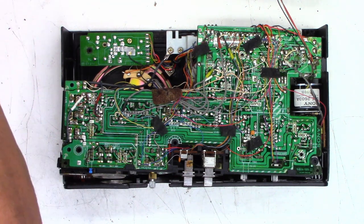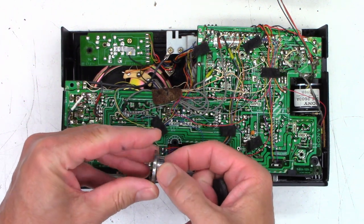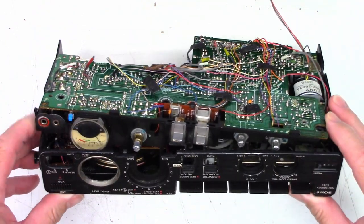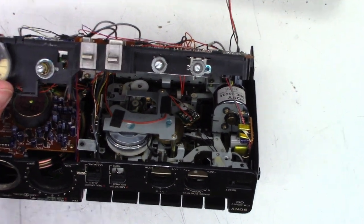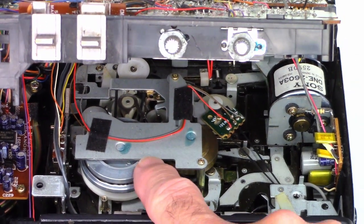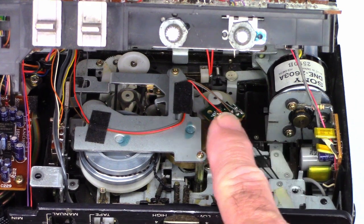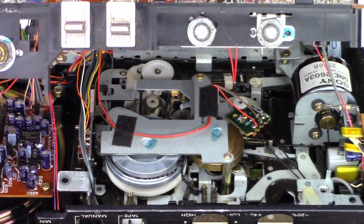Some time has passed and I did get the knob off. I had to remove the rubber portion and then grasp it with pliers to amicably divorce it from the volume control. I have the board up — not all the way up, but up a little bit. Look at that mechanism right there. By the looks of things, this belt runs around another idler flywheel and then does a twist and loops up and around the motor and back. I'm going to go ahead and look up the service manual on this unit.